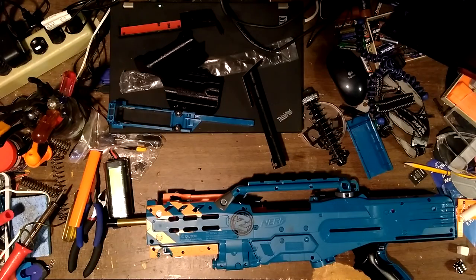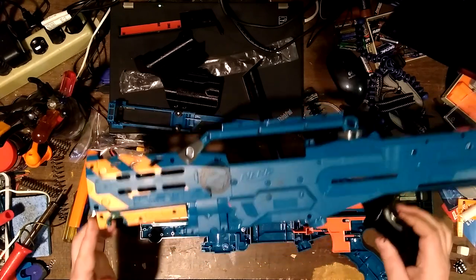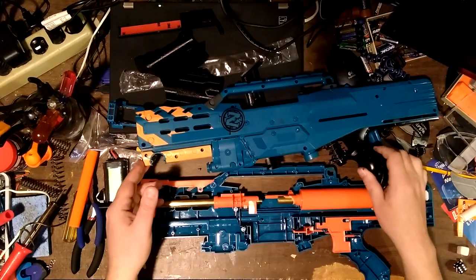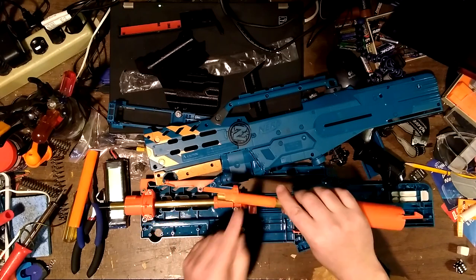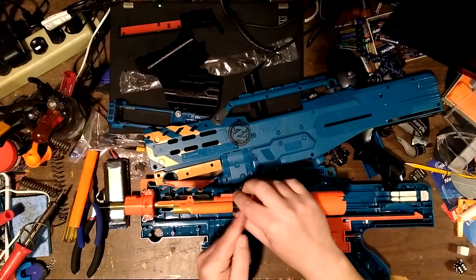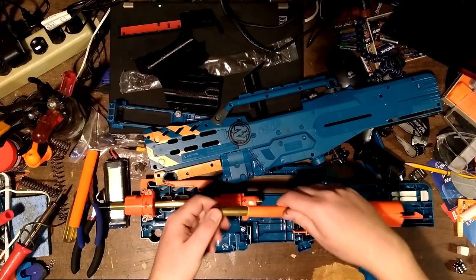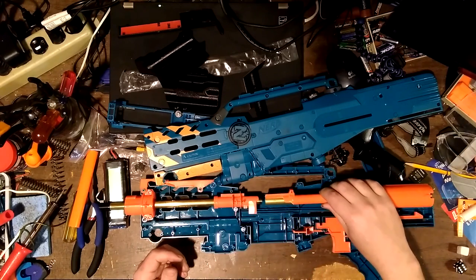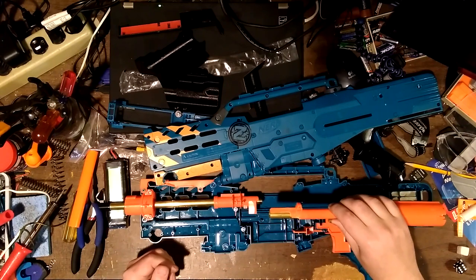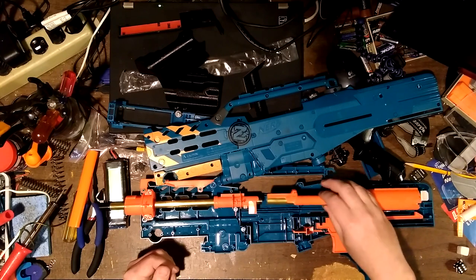It is the day after which I last spoke to this recording device, and here is the status update. What have we got? I finished drilling out the bolt, whatever this part is called, so my 9/16 brass can fit entirely in here. I cut away a bit more than I needed, but I don't think it'll be a problem since this just goes over the 17/32 brass, so that's ready.